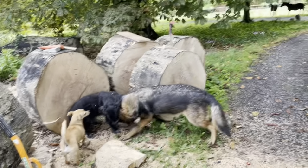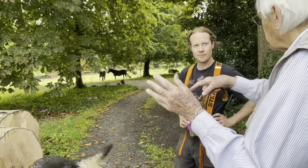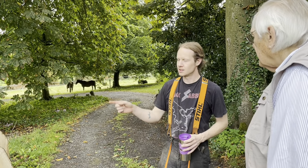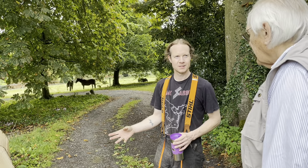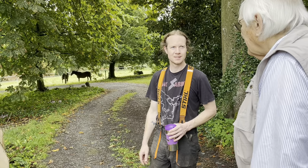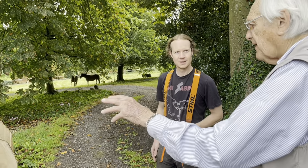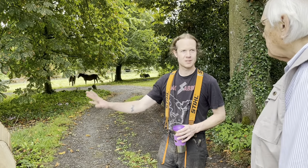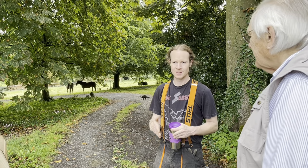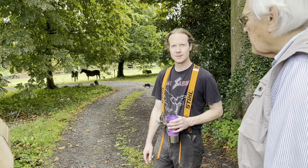When you take these to your studio, do you have a way you put them up in the air, so to speak? Do they have to season a bit more now that you've cut? No, I'm going to turn these tomorrow into rough-turned bowls. And then they go into my kiln. It takes about 8 to 10 weeks to dry them. To dry them. Okay, that was my question. So you don't dry a chunk. No, you dry the turned rough bowl. It'll just crack. So what you want to do is turn the bowl to a thickness that it won't crack, but it'll dry quick enough.